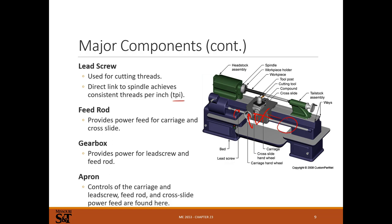Since the lead screw will have different starts, there'll be some way of guaranteeing it gets locked into a specific start. There'll be a little indicator wheel with markings for the different starts, and a separate little clutch that you engage to make sure you're on the right start. If you start threading with multiple passes and engage the lead screw at different starts each time, the threads will all be in different locations - it's a complete mess and you scrap your part. This is more of an art form; you really need to see somebody do it and learn from them to do it correctly.